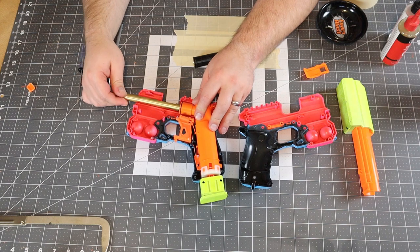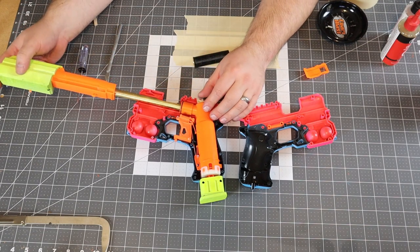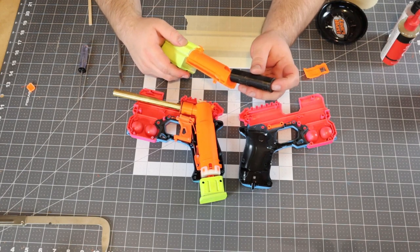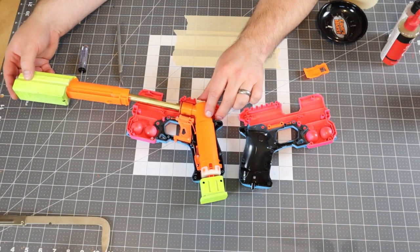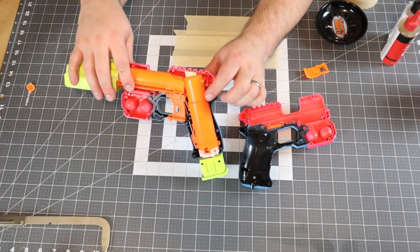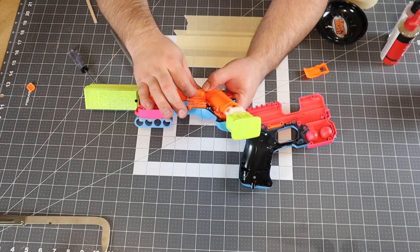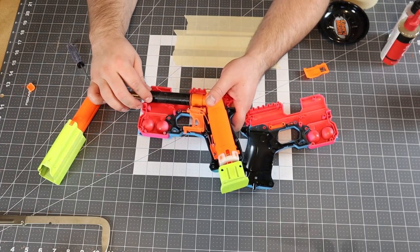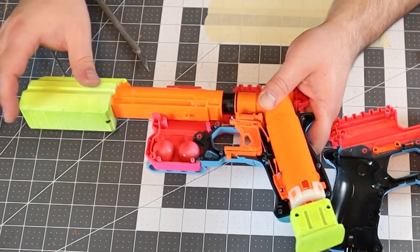Now, word of caution, before doing that, make sure everything fits perfectly. I actually had to put this thing all together, and I found that this 3D printed part was not allowing the tolerance I needed for this thing to completely close right here. When it was fully closed, as you can see, this still might need a little bit more, but essentially this lock right here looks like it's not engaging. I had to take material off here so we can get up closer, so that this lock engages. That way when you hit the switch, this return spring will pull it open.